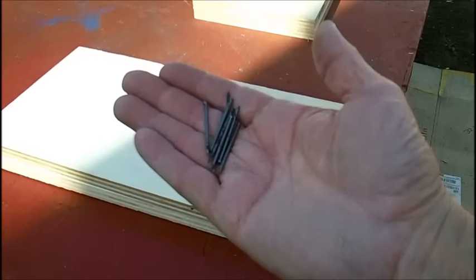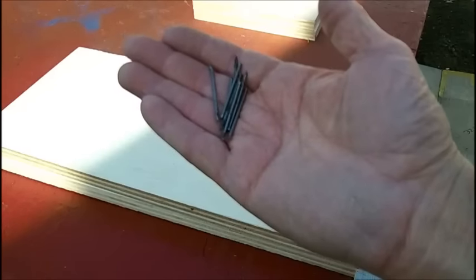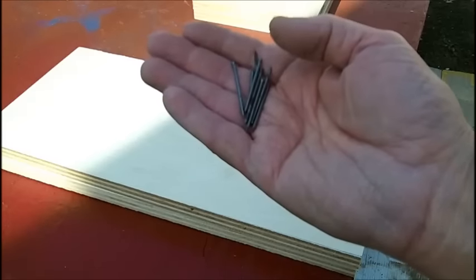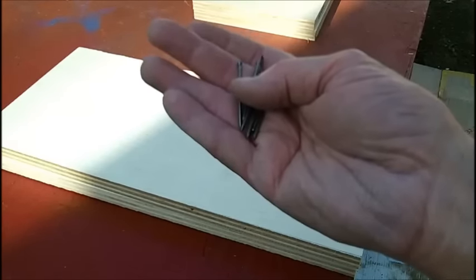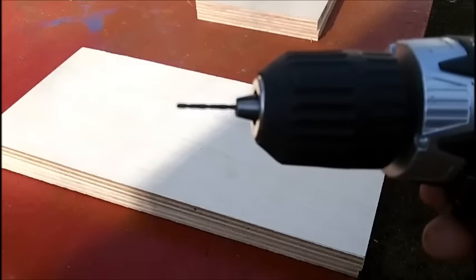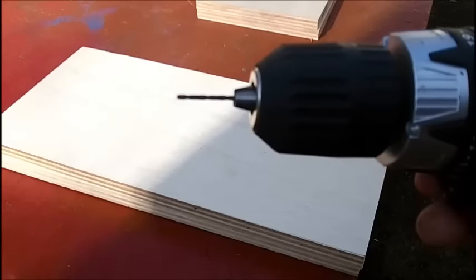I'm using inch and a half finish nails. I don't worry about galvanized because this is inside the house, but I'm going to pre-drill — finding a drill bit just a hair smaller than these finish nails so I can drill through the first piece of wood. You can't bang them in direct into three-quarter inch plywood — they'll bend over every time. Pre-drill and don't make the hole too big or the head won't hold. I'm using a 5/64ths bit; these bits break very easily if you're not careful.